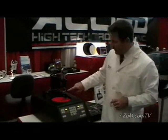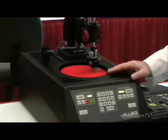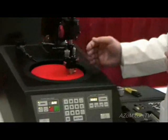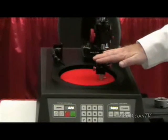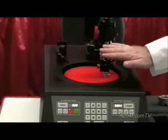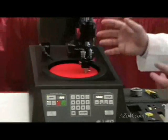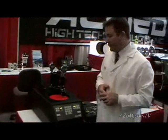Beyond this mechanism, we also have two micrometer heads. If the sample is mounted in an orientation that's not parallel with the wheel, the micrometer heads can control the radial angular orientation, and the front micrometer can control the axial orientation or pitch. That gives you flexibility in adjustment of your sample based on its conditions and geometry.